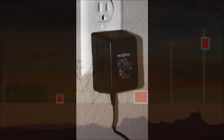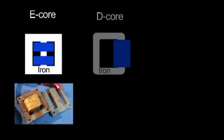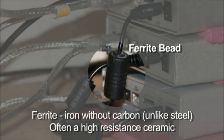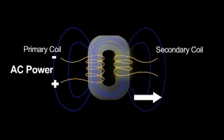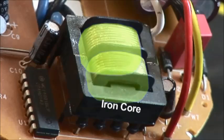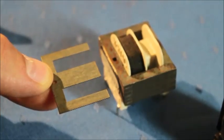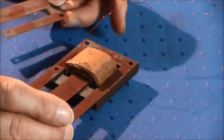Transformers are extremely important in electrical power systems and are found everywhere. They come in many shapes and sizes and do many different jobs, from changing voltages to stopping radio interference in your favorite appliances. Transformers use an iron core to transfer magnetic energy from one coil to another through magnetic induction. The iron core is made in different ways; this one is made up of what's called steel laminations — a bunch of plates of steel all sandwiched together to make up the core.